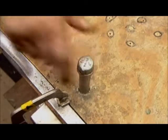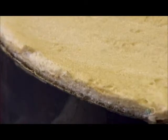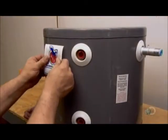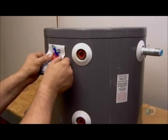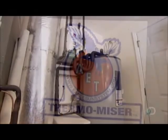How does it all work? The potable cold water in the home's water heater circulates through the loop inside the exchanger. It absorbs the heat brought in from the solar panels via a completely separate set of pipes, and the potable hot water then exits the exchanger and returns to the water tank.